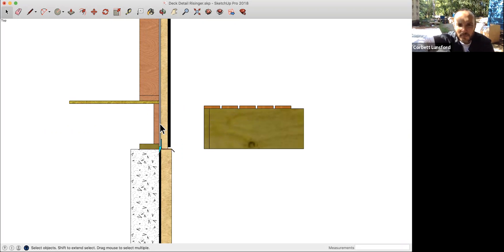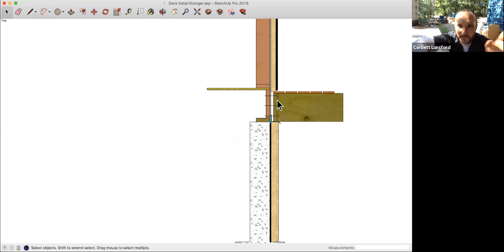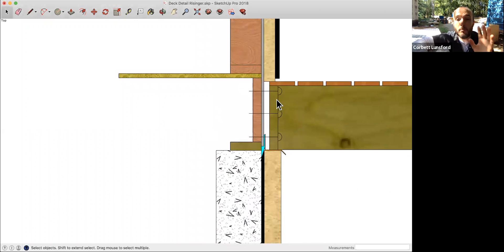The ledger and rim need to be generally pretty close to each other. The way most builders are going to do it is just slamming the ledger right up to the sheathing — so there's a half-inch gap between the ledger board and the rim board — and getting rid completely of the exterior insulation, which is not my favorite. What I saw on your video for moisture control is deck spacers creating a half-inch or one-inch air gap between the ledger and the rim board.